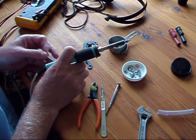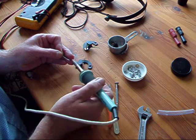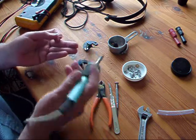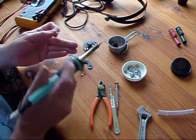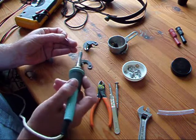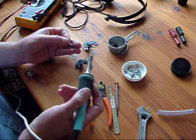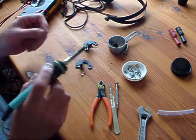I've now twisted the end of the coil wire onto the lead wire, and I'm just soldering it back into place. If you can learn to solder like this it's very useful — hold the component you want to solder between those two fingers, and then the solder between your finger and thumb. It's like having a third hand. It allows you to bring things together and bring the solder to the joint — a very useful technique.